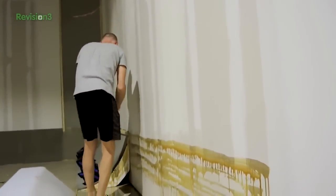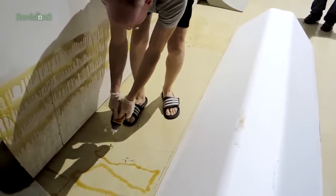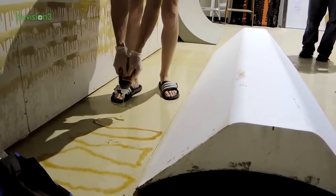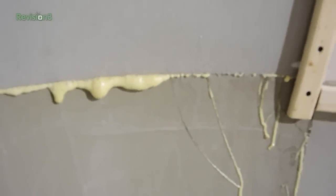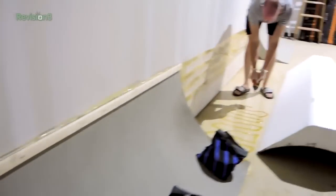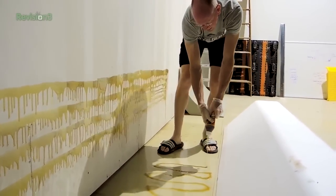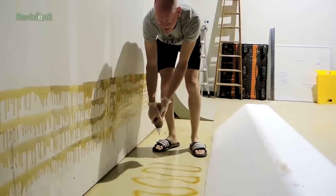You didn't put it down below because there's a gap in the foam, so it would be a waste. Now we're going to put it all over the floor - basically painting myself into a corner. A healthy amount every three inches or so is pretty good. Another thing about this glue is it expands - you can see it on that seam where it's already drying, it's poking out of the seam. That's one of the things that makes it so strong - it fills the voids. These bottles are hard to squeeze and it wears your hand out.